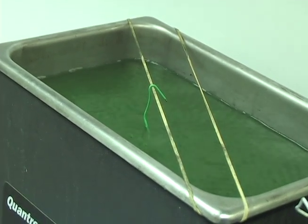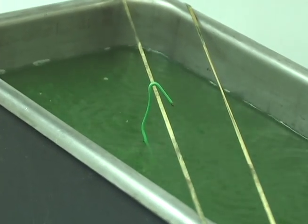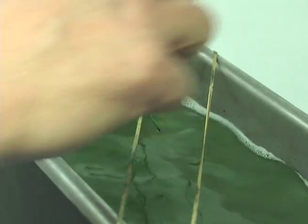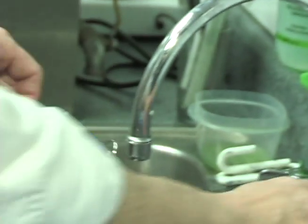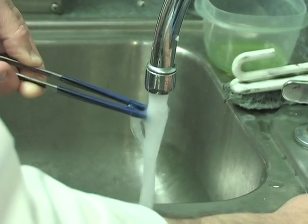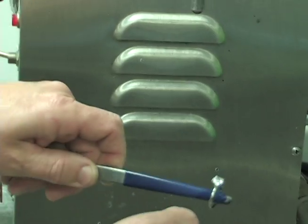He places the ring in an ultrasonic cleaner. Transducers on the bottom of the tank produce ultrasonic waves, a process called cavitation, which removes any residue left from the Tripoli and rouge compound from the polishing wheel. With white gold, the jeweler is going to rhodium plate the ring for added protection.